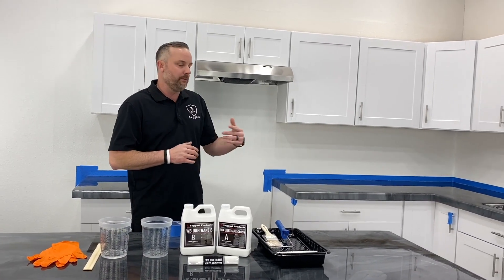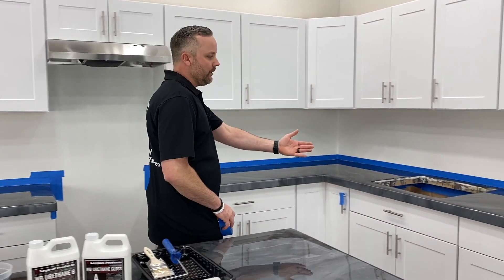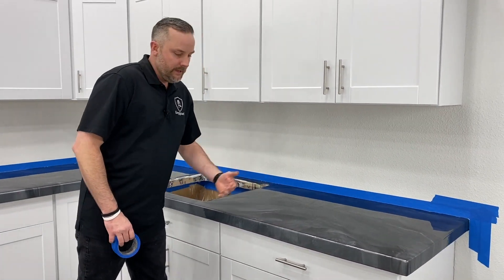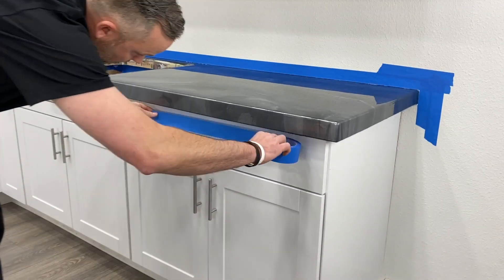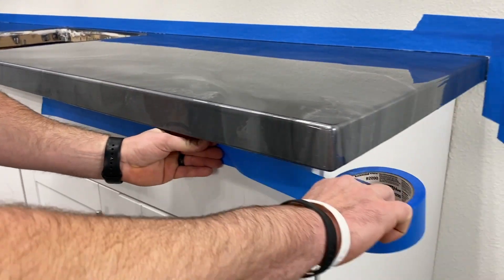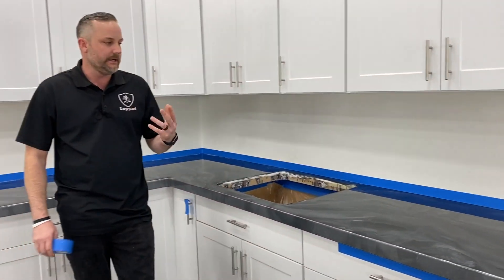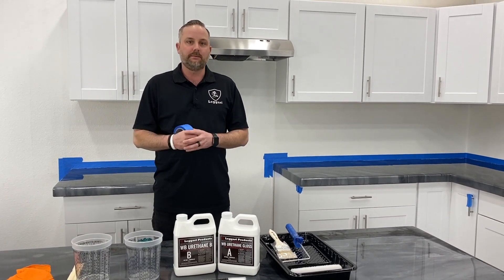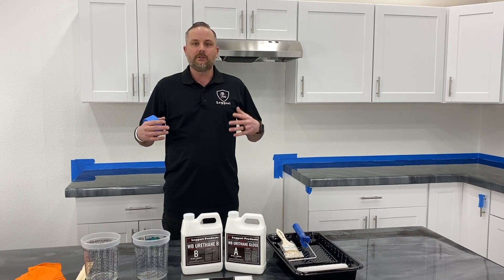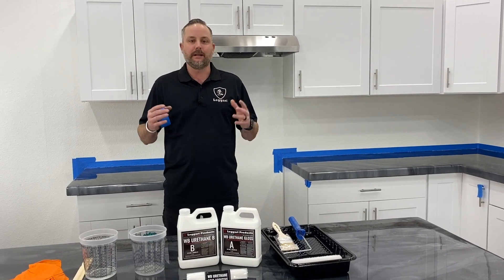First things first, you'll notice we pulled the plastic — that's okay. This isn't going to run off and flow like epoxy. All you need to do is tape anywhere your roller is going to touch, maybe your backsplash or the wall, and if your counters aren't overhanging enough, run one strip of tape on your cabinets just in case. This cleans up with water, so if you get a few drips on the floor just wipe it up — not a big deal. It's a very easy product to apply. This is a great product for rejuvenating old or worn countertops, no matter whose product it is. It's going to shine them back up and add a lot of strength.